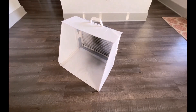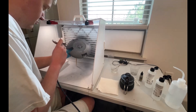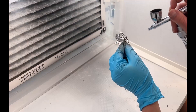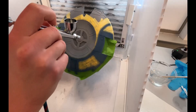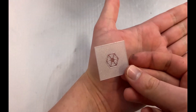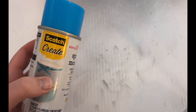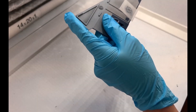Everything fit really nicely and it was ready to use. Here are some shots of me painting parts of my latest project, which is the droid gunship. One cool thing I experimented with on this project was a 3D printed stencil. It's only 0.2mm thick, which is only a single layer, so it's flexible and easy to work with. For sealing the stencil to avoid paint bleed, I used Scotch Create spray mount on one side — it's a light tack spray adhesive used a lot by scrapbookers, and it works a treat.